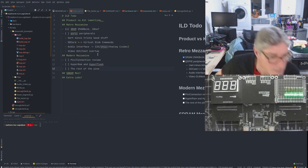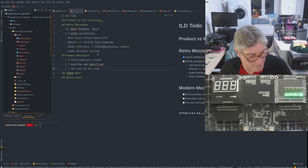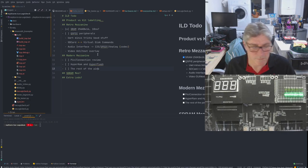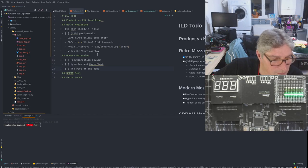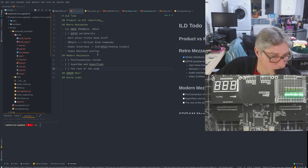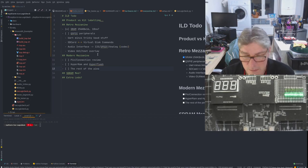I'm guessing. Sixteen bytes per character, about 200 characters. So 320 bytes. That's tiny. No, 16 bytes per character, 200 characters. So the font itself takes 320 bytes, yeah? Or thereabouts. No, 3,200 bytes. Yeah, sorry, my bad. 3.2K, which is substantial. If that's got to go into, say, the 16K, that takes a chunk out.